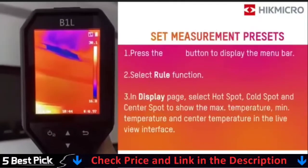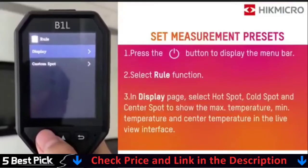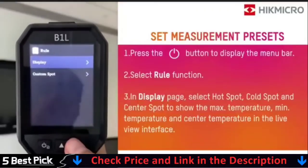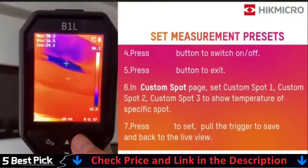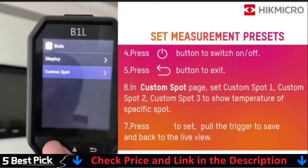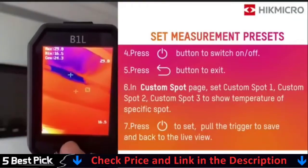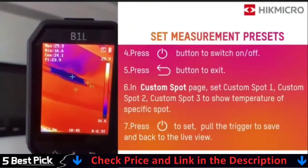With 256 by 192 IR resolution, 49,152 pixels, thermal sensitivity of 0.04 degrees Celsius, and a 2MP visual camera, B10 Thermography Imager provides high-definition images, and it is easier to spot subtle heat loss or gain. Fusion blends key details from the 2MP digital camera into the IR image, adding detail and clarity. PIP picture-in-picture overlays a fixed section of a thermal image onto a digital photo to clarify anomaly locations.